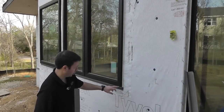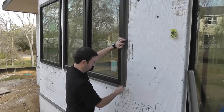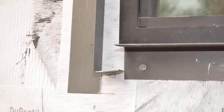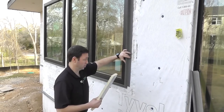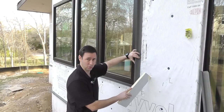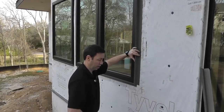So here's how we've solved that. We worked with the architect to come up with this detail. We've already put this bottom piece on here, but we've come up with a flashing detail — I'll show you a detailed photo of this on the video. Basically what we're doing is putting this flashing on so that we can thicken the depth of the window, and now I have something to put my siding — in this section of the house we're actually doing Sto — to butt up against. This flashing piece is not necessarily meant to be waterproofing, so the details are easier because we're not really trying to make this 100% waterproof. If water gets behind there, no problem. We've got the DuPont Tyvek drain wrap that's going to leave just a little bit of gap for this foam, and we'll let water out.